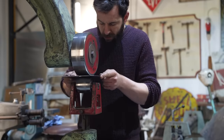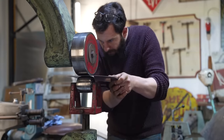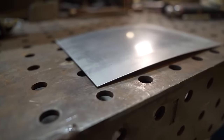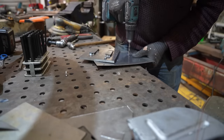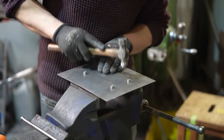I will bolt the sheet of steel, drill a couple of holes and bolt it to the plate, then use my hammering tool - which is essentially the ball bearing with a piece of steel welded on the end - to push the panel into the valley that we've made on the mill. That should give me an exact replica of what I need. I've got my piece of steel - flat sheet at the moment. This is absolutely trial and error. With my ball bearing on a stick, I'm asking this sheet of steel to stretch quite far. It's going to want to pull material in from the edges, which will essentially make it sort of dished. So I'm going to use the wheeling machine to pre-stretch the area where we're about to hammer it into the form. That will stretch the middle area, leaving the outside edge like a frame, and just stretching the middle so there'll be way too much material in the middle - it will bulge up. Then I'm going to bolt it to the form so it can't move and then push it into the hole with the bearing on a stick.